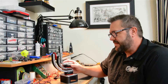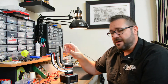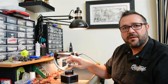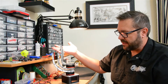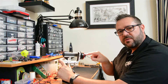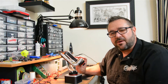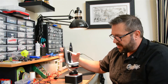That's it — it was pretty easy to put this together. I spent a lot of time in Fusion getting all of the specifications and tolerances just right, so the gimbal looks almost exactly like the Fusion diagram. The physics of it all still work properly. You can see how the gimbal will hold the camera — it will have your roll, tilt, and pan, and it folds up nicely into a pretty small, compact unit. Next steps: we have to redesign the cores to route the wires better through each of the gimbal arms, through the holes of the motor, around the gimbal arm, and down into the base. These wires need to be in place so we can connect it to the circuit board we finished last week, which will allow us to control and respond to movements in the gimbal, and then we'll be able to start programming it.